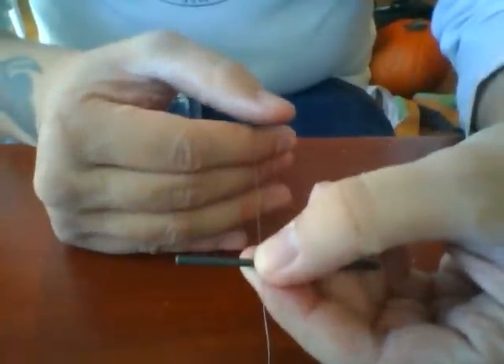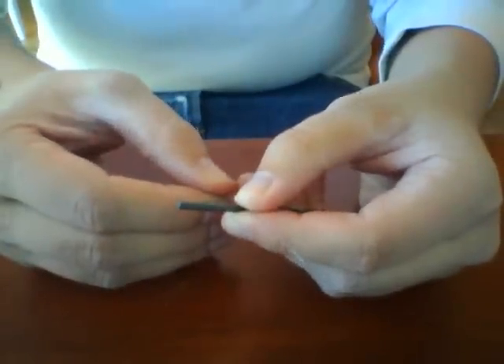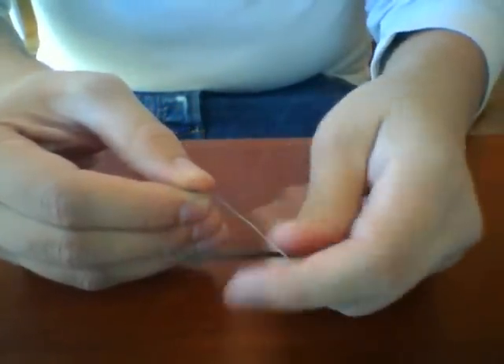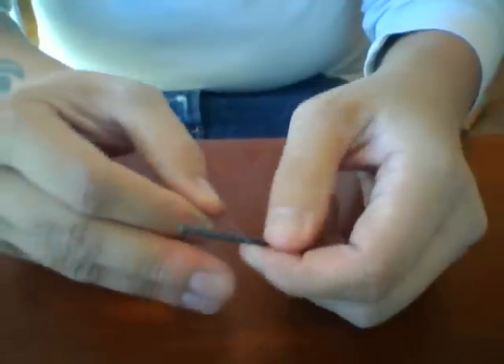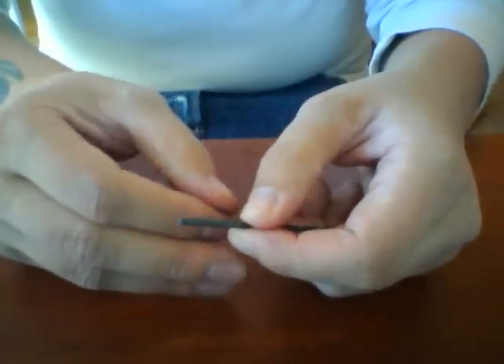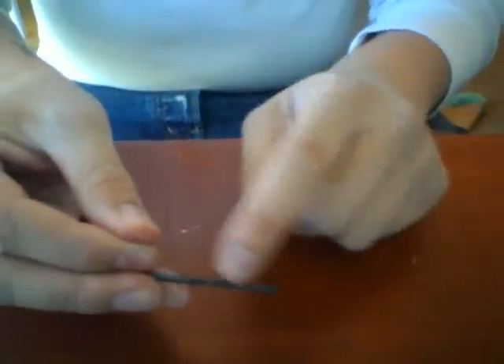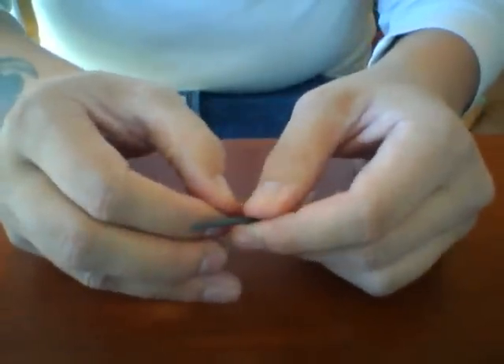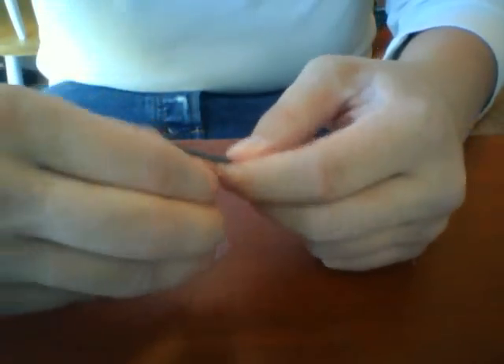What you're going to want to do is leave a little lead on the end — a couple inches, inch and a half to two inches. Then take the solid part of your drill bit — obviously not along the ridges — and start wrapping. Make your wraps very tight; the tighter your wraps are the better this coil is going to perform.